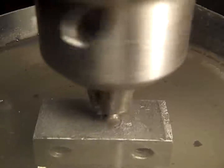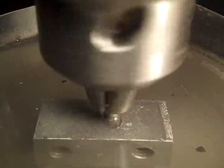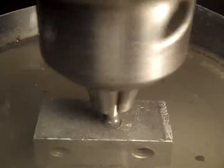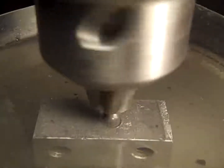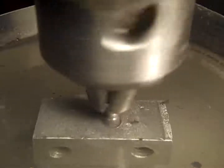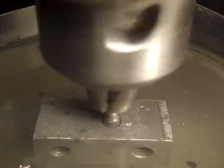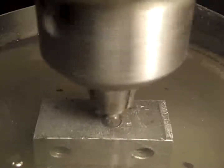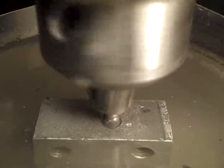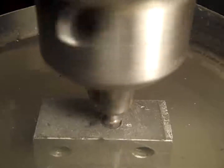And they work well for cutting through like cast iron or anything really. You cut through porcelain, even glass. I don't know if I'd try to cut a 42 millimeter hole in glass with one. I guess if I had to, I would. You have to be very careful. I would imagine you'd spin faster in glass, and very, very light feed rate.